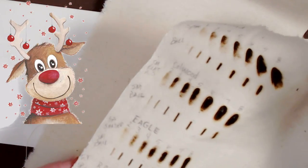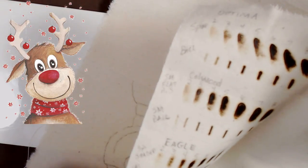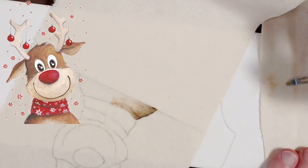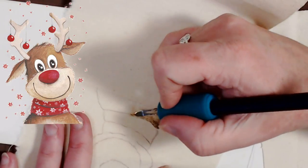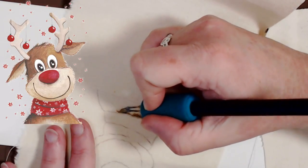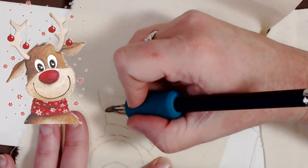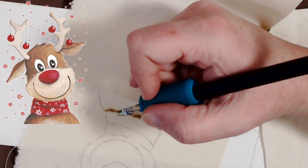I may have to bump this up even hotter. That's one of the reasons I did this little test strip — I can see without playing too much how much heat is needed for a given setting. Like paper, canvas is going to need a higher setting. I went up to four, using the bottom of the strip to test. It also polishes our tip without even trying. You could actually use canvas to clean your tip, or if you have a duplicate project on canvas and wood, you could put the canvas on top of the wood and burn hot — it'll burn both at the same time.